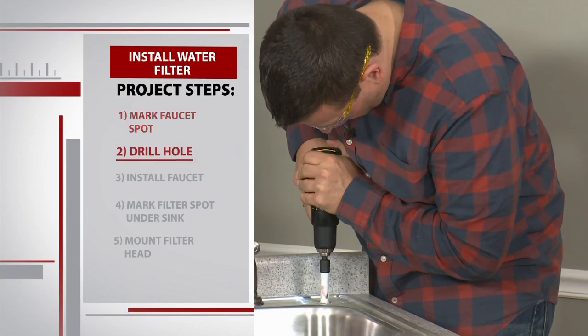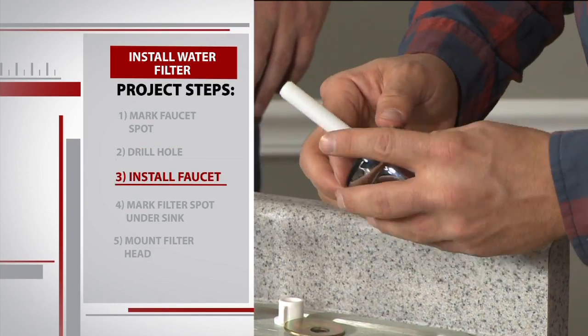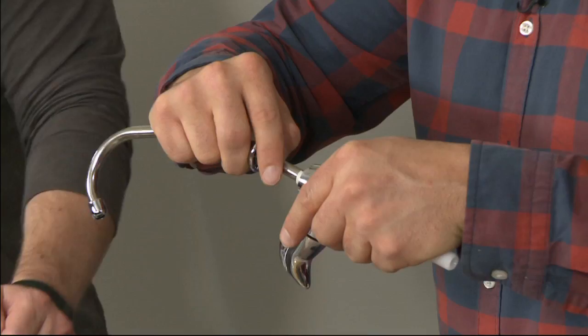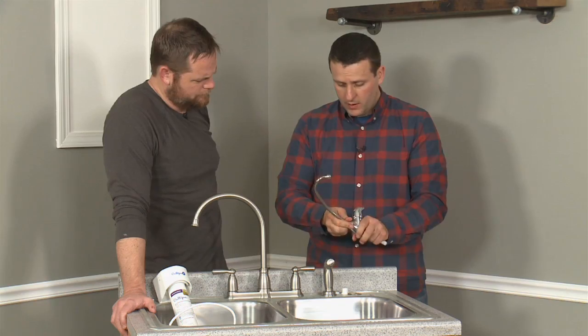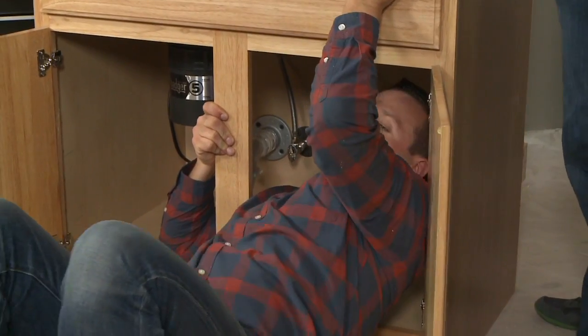Sean safety gears up and drills the hole very slowly and carefully using the mandrill drill bit. The next step: let's go ahead and install the faucet. We prep the faucet by setting up the base, connecting the spout, and screwing the trim piece on. After that, we make sure the faucet is straight and the gasket's in place, and we tighten it onto the sink.